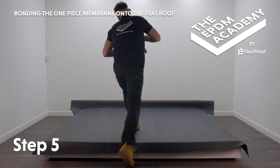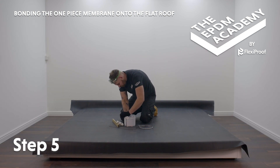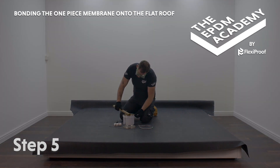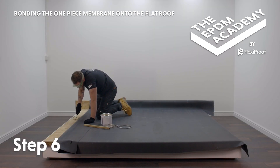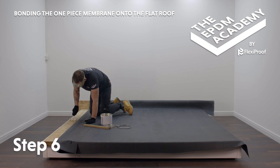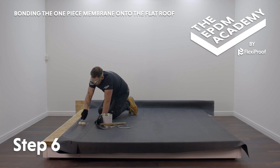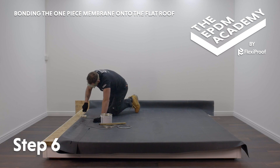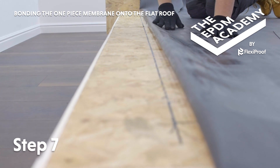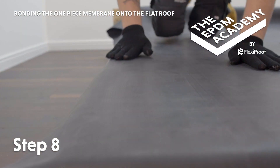Place an offcut of membrane or cardboard onto the newly installed membrane surface, then place a tin of contact bonding adhesive onto that protective layer. Put on your safety goggles. Stir the adhesive with a piece of roofing batten or a stirrer. Use a mini paint roller to apply an even coat of contact bonding adhesive to the previously marked 150 millimetre strip along the roof deck edge, then along the corresponding membrane underside. Check the contact bonding adhesive is touch dry — this will prevent any gas bubbles forming underneath the membrane. Lay the membrane onto the roof deck and smooth it into place by hand.